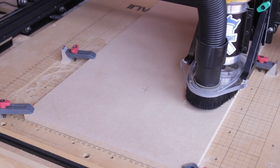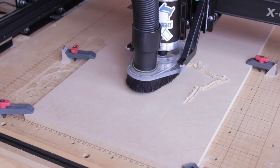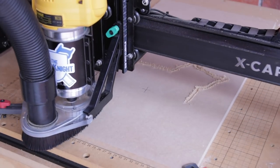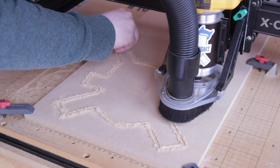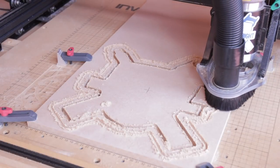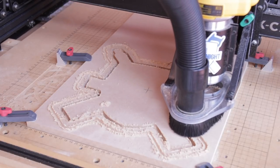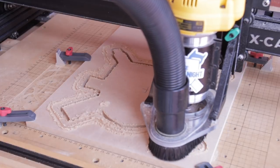Because I only needed a quarter sheet of MDF for this, I grabbed something from the big box store. It turns out this is lower grade MDF than I'm used to, and summer in Melbourne usually has big humidity swings, which made this the fluffiest MDF I've ever encountered. While downcut would have been cleaner, I was genuinely worried about being able to clear the tool paths. The dust extraction wasn't pulling enough out, and I actually had to clear it with a screw while the CNC was still going.